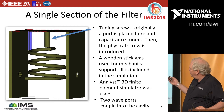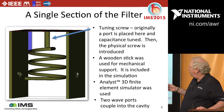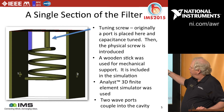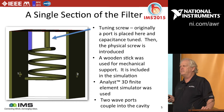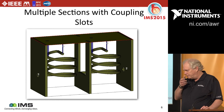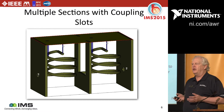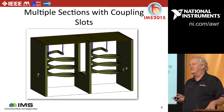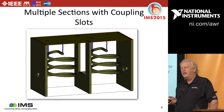The EM simulation was carried out using our Analyst tool in the software — it's a full finite element method. He started with a single cavity, a single coil. You can see two ports coupling to the outside world and the tuning screw going down. That blue rectangle on the side is just mechanical support — a wooden dowel — but of course it could load the cavity, so he included it in the simulation. Now, what you do not want to do is run EM simulations with nine million tuning screw positions, because that's nine million EM simulations. So at this point you have to be clever, and fortunately Phil is.